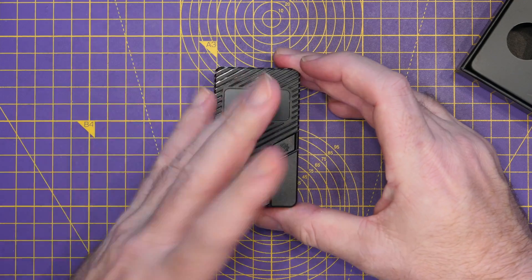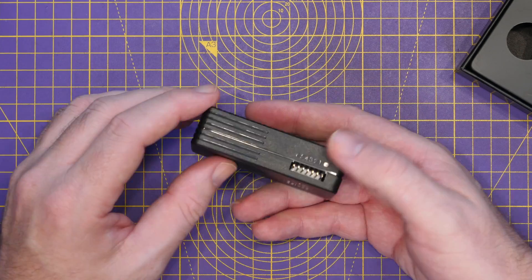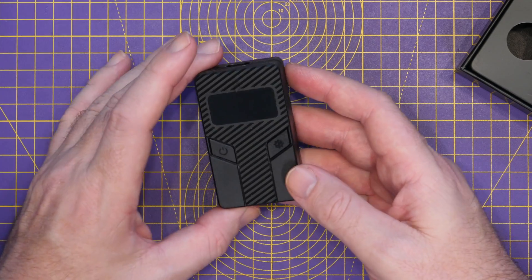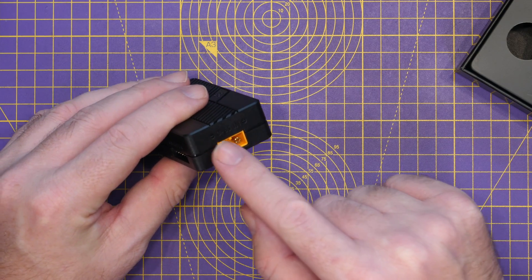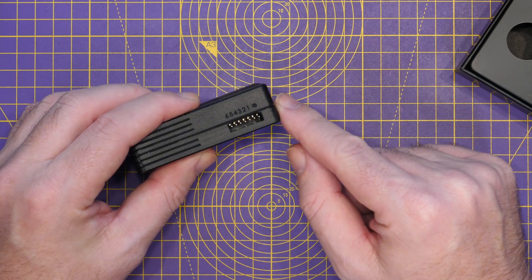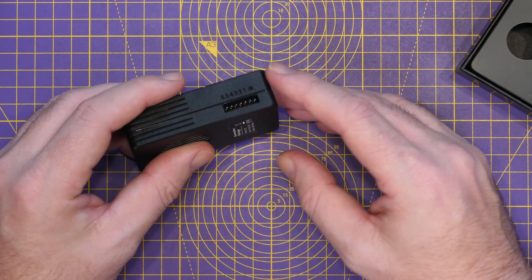Basically, this is a power delivery charger that supports a LiPo battery, allowing you to safely discharge your LiPo battery whilst charging another device. On this, you'll find an XT60 input at the bottom that supports 3 to 6S. There is a balance port on the side, labelled negative, 1, 2, 3, 4, 5, 6 — so again, up to a 6S battery.